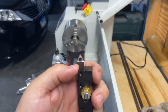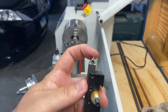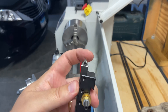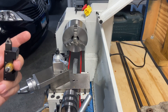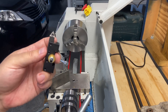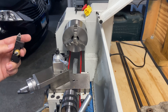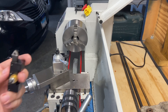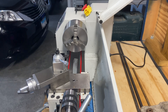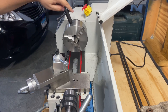There are three wear-outs per insert, and you can move these to different tools before you need to buy more. So let's get another test piece in here and do a couple test cuts — see how the quick change works, face a bolt off, chamfer the edges, and see what it looks like. Let's get the three-jaw opened up.